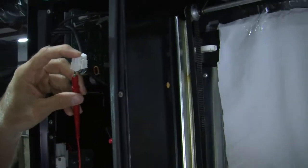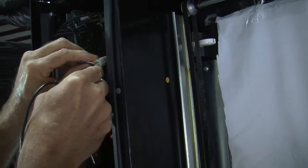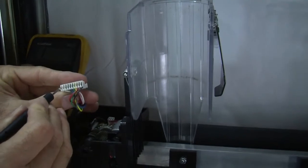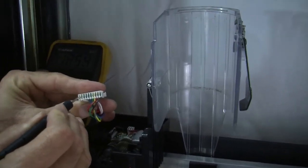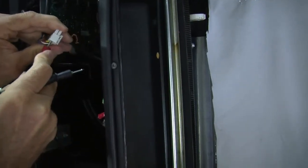Never insert into the face of the plug, because you'll malform or deform the part that actually plugs into the machine. At that point you can let it hang. Identify the color that you've punched in on that side and touch it on this side — just like that. You're going to go right down the row, one color to the next, to the next. Anytime you get the audible tone, you've got continuity through the harness.